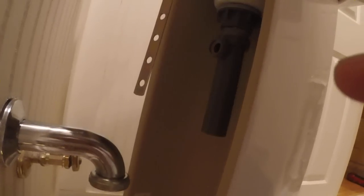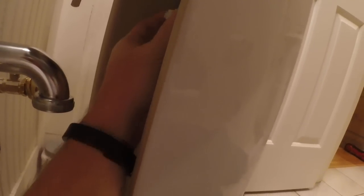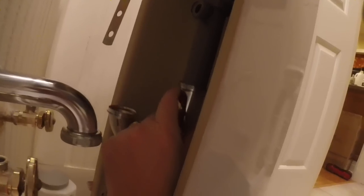The other thing I ran into is with the drain elbow. We were switching over from brass to a chrome look as we update. The elbow comes in here and attaches to this gray down pipe, which actually came with the sink. The idea is you take this ring, put it up over the pipe — there's a gasket that goes down in there — and as you put the pipe up, you thread it right on. It slides down into the pipe and you thread it down, creating a kind of friction fit. You want to make sure that pipe goes all the way down in there to get a nice tight seat.